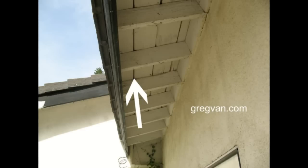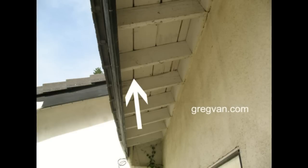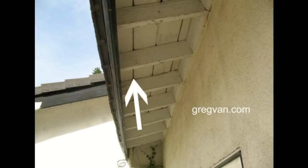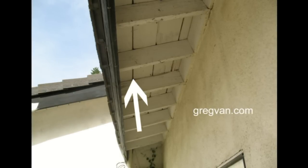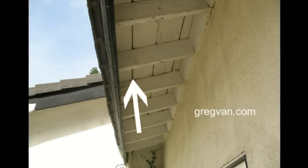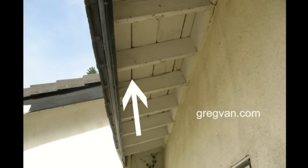Here's something that happened to me, and of course the reason why I'm making these videos is to keep this stuff from happening to you guys. What I did here — I was building a room addition and I decided to pre-paint all of the 1x8 shiplap, except I was not planning on this wood to shrink. When it shrank, it actually exposed the edges that I obviously didn't paint.